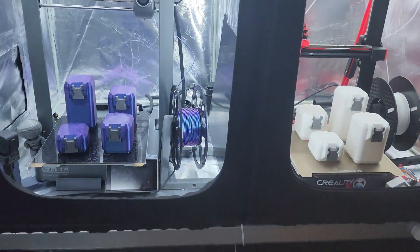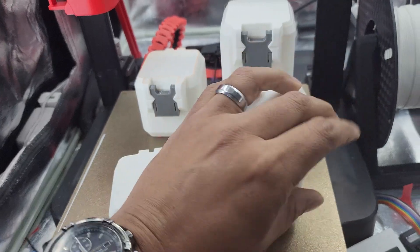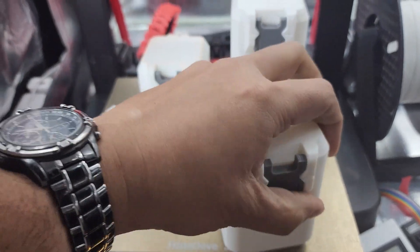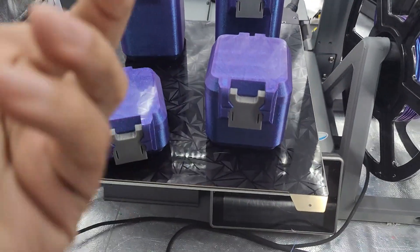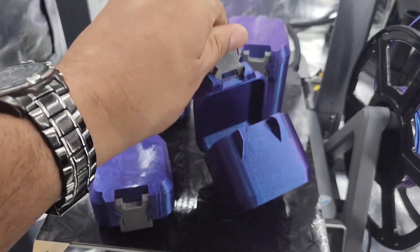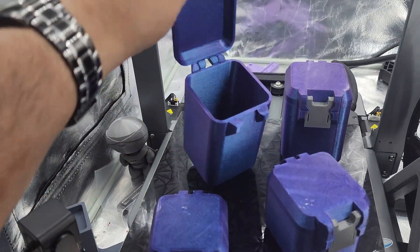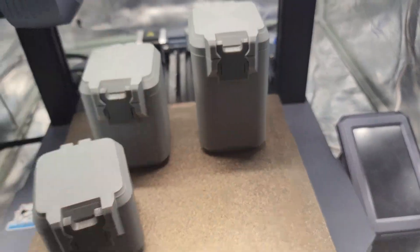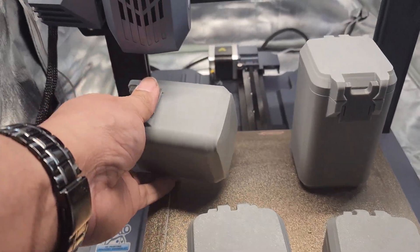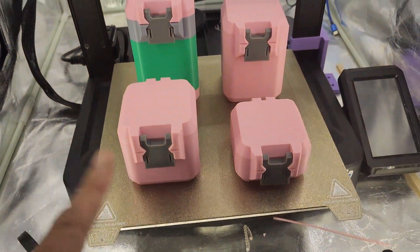The final results of the PLA containers: the SE Diablo has beautiful prints, no issues, they all open and close — great print. I cheated and swapped in the cool bed since it was working so well — those also open and close with no issues. The CR10 is similar but we did get some warp on the bottom. The Z offset needs to come down just a smidge, otherwise it's starting to curl.